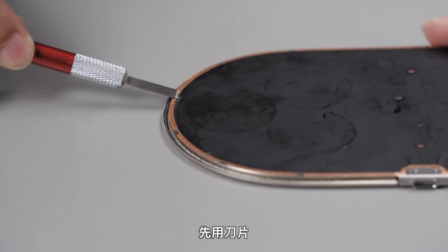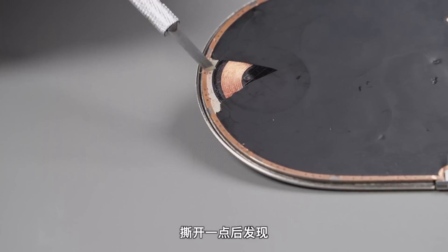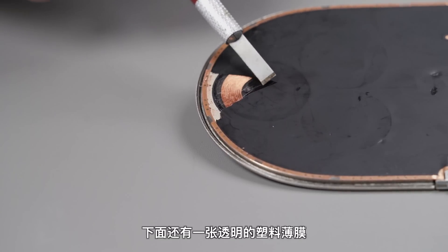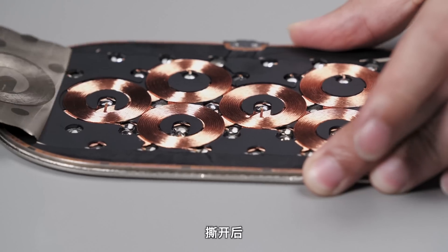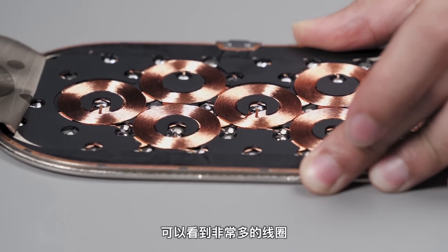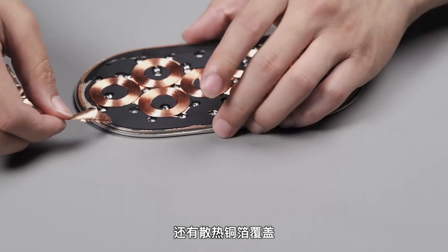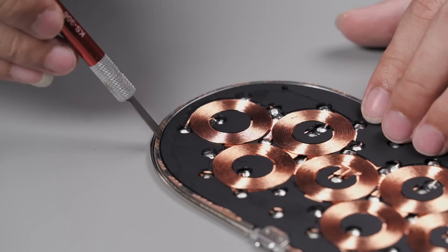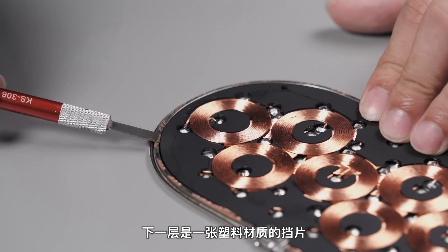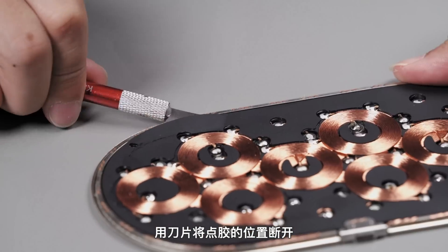Next up, let's look at the semi-manufactured Air Power piece. First, with the blade, cut off the top graphite stickers. By peeling off a bit, we found a transparent film underneath — continue with the blade to pry it up. Pull slowly. Once that's done you can see a lot of coils. So far we don't know how many there are. The outer loop is covered by some thermal copper foil that's actually quite thick. The next layer is a plastic shield, and underneath there are many more adhesives — cut through these glue spots.